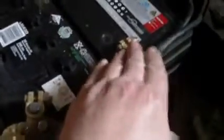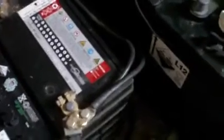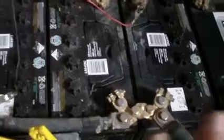And this is finished off at the end with a, well, this is a different battery. This is a Newton Power, and this is 450 CCA, a little bit stronger, a little bit better reserve capacity. I can't remember exactly how much now, I can't see it on the label, but this is a calcium battery, and it's a low maintenance battery, so, well, no maintenance, you can't put any more water in it. I did actually have more batteries on here originally. I think it was 8 on this original bank, but once I started doing this B bank over here, which I'm not really going to talk about today, and I got these gels here, which was my favourite, stored in gels for the lighting batteries, I cut this bank back because it was only meant for the day use.